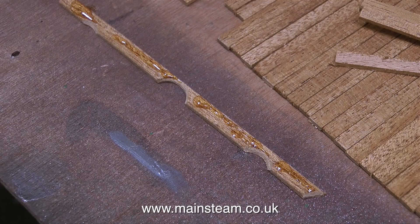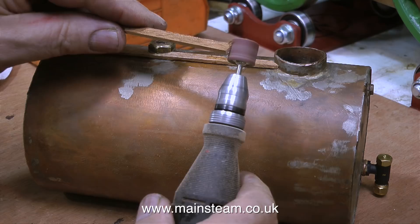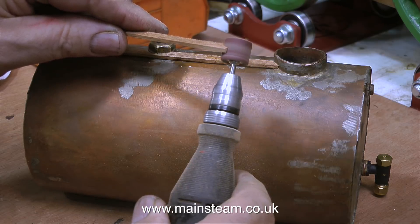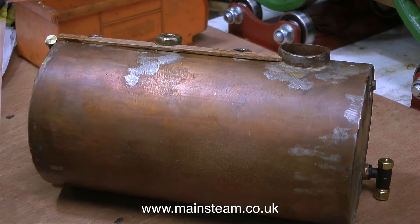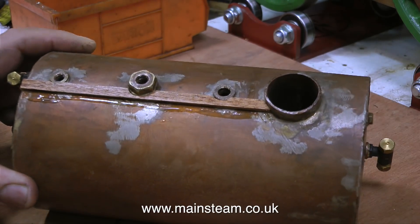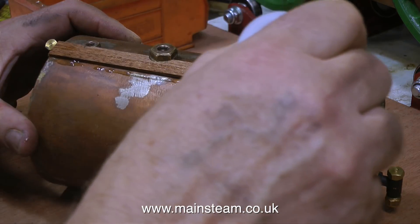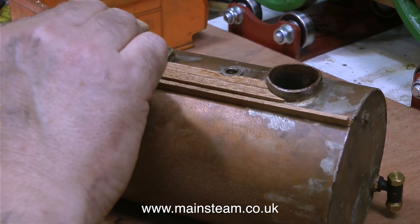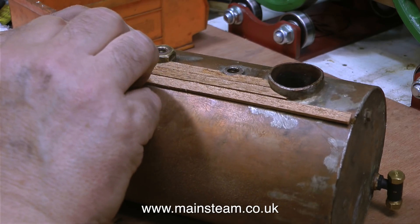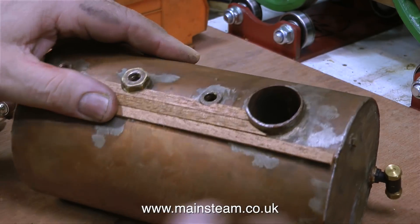There now follows a gluing extravaganza. My adhesive of choice is cyanoacrylate adhesive, also known as CA glue or superglue. Here's yet another good tip: when you cut the ends of the planks to fit around things on the boiler like bushes or the chimney, always do it at a slight angle, because if you look at the bushes on the boiler you will notice a fillet of solder at the base of the bush. So if you cut the wood square it will be held off the bush by the solder around it. With the first mahogany plank in place it's time to fit the second one, and I'm now putting adhesive on the boiler to fit the third one, which is the first that runs the full length of the boiler, so after this one the job is going to become a lot simpler.